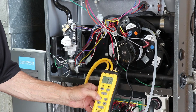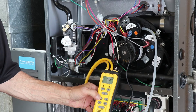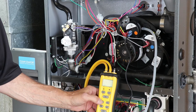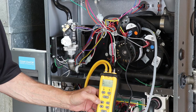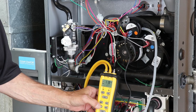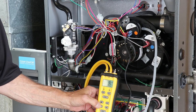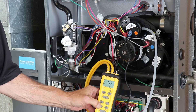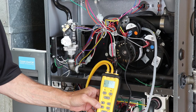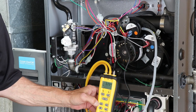As we pump — turn the pump up and we get to our closing pressure — once that switch is closed, the little light on the machine will come on indicating that the pressure switch is closed. Then you can back it down and see exactly where that pressure switch is opening. This particular pressure switch re-opened at 1.13, so the pressure switch is good.